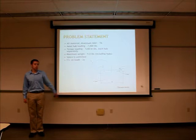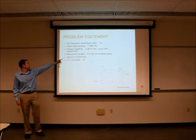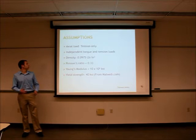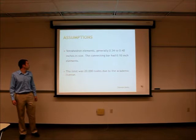We were given two hubs — the bigger one is a wheel hub, the other is a drive hub. They are to be spaced six inches apart and our goal was to design a beam that would withstand the specified loads. The material is aluminum 6061, the part must weigh no more than nine pounds, there is no space limit, but the factor of safety has to be no less than two. For assumptions, we assumed only tension for axial loading and that the torque and tension loads are independent from one another, and we assumed the listed physical and mechanical properties.